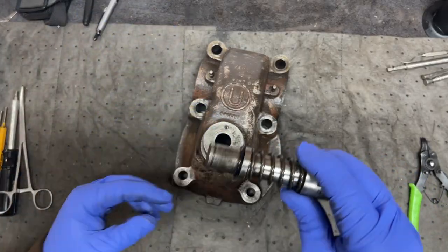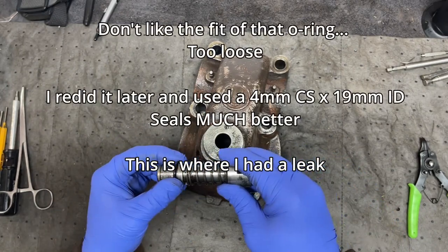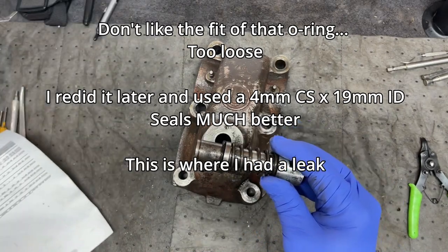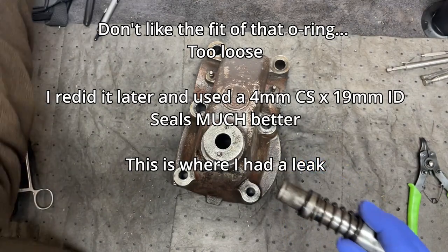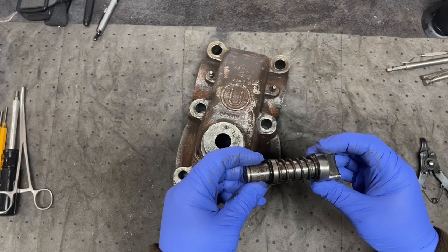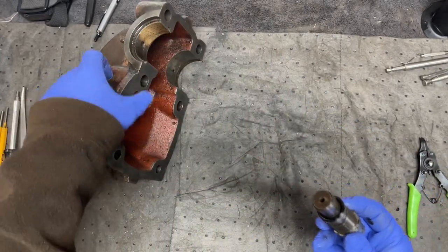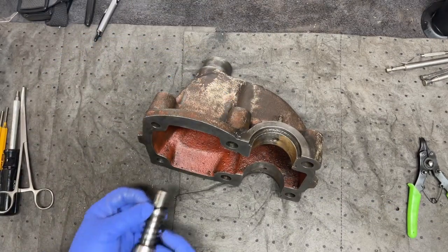-115 O-ring, let me check and verify. O-ring, 3/4 inch internal diameter, 75 durometer, dash number is -210, 1 inch outside diameter, 3/4 inside diameter, and 1/8 cross section. It's what's specified in the book, at least. So we'll try to send this back home somehow.